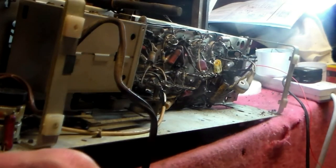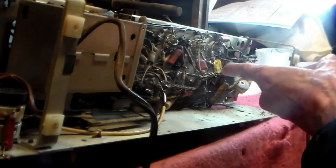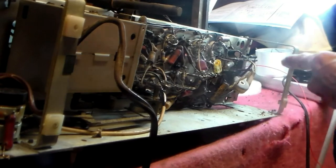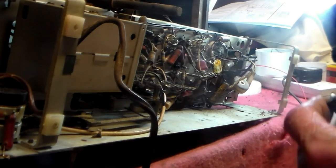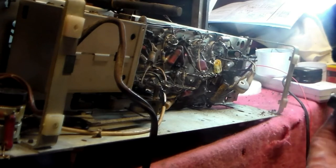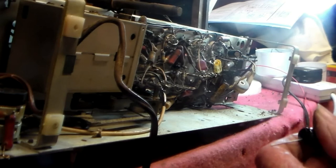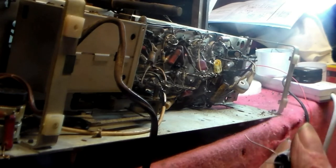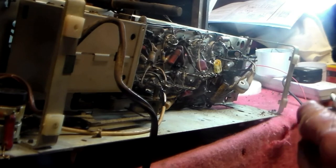The next capacitor has been changed. It is an electrolytic capacitor. Now, these are polarised. Unlike that one, which can go in either way around, electrolytics go in one way. They mark negative and positive, red and black. And this is one here. One end is marked negative. The other end is positive, yeah? The positive end is usually longer than the negative end.